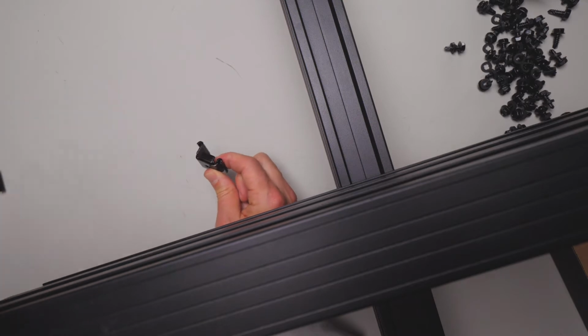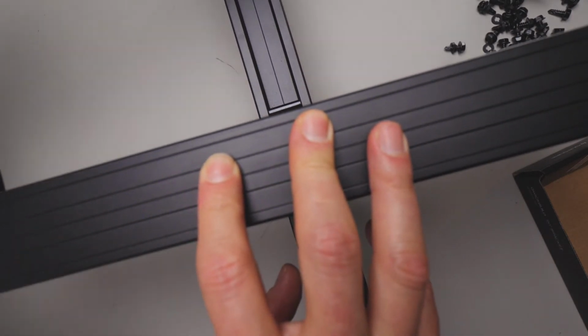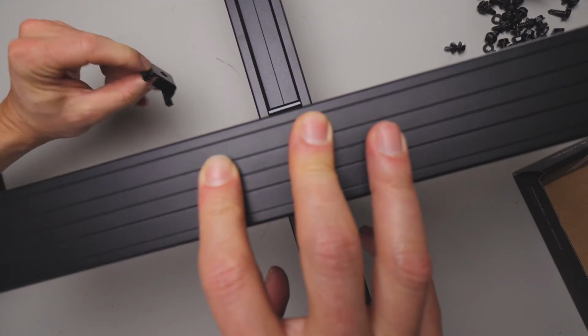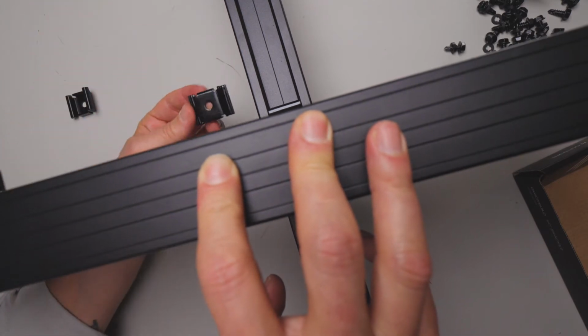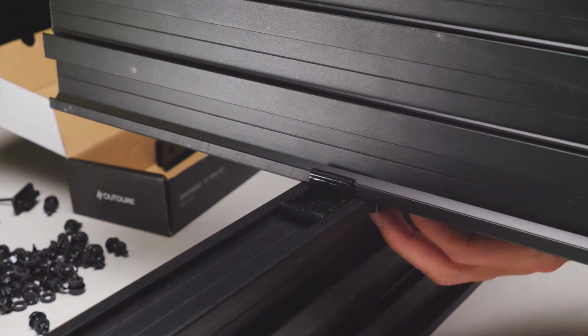To anchor down larger profiles, say this one here with the 3 channels, now you're definitely going to have to anchor this on both sides, so you're going to use a joist anchor there, one there, right. Now depending on what the engineering requirements are, you may need to put a joist anchor underneath. So you will go underneath that joist and you'll hook it onto the bearer that way.